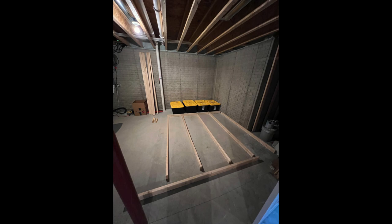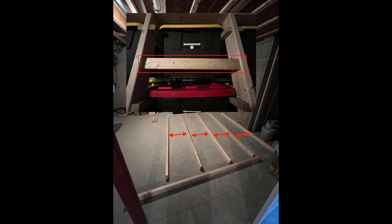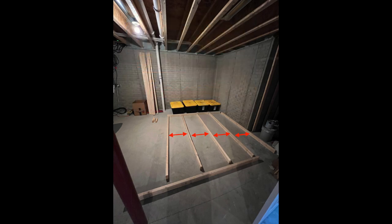I did not do a good job of filming this build, but for the 2 main wood frames, you will want to put 2 structural screws or framing nails into the top and bottom plates and into the 5 studs to build the wood frame. When putting together the 2 framing walls, use the 21 inch 2x4 that we cut as a spacer to get your spacing between the studs accurate and consistent.